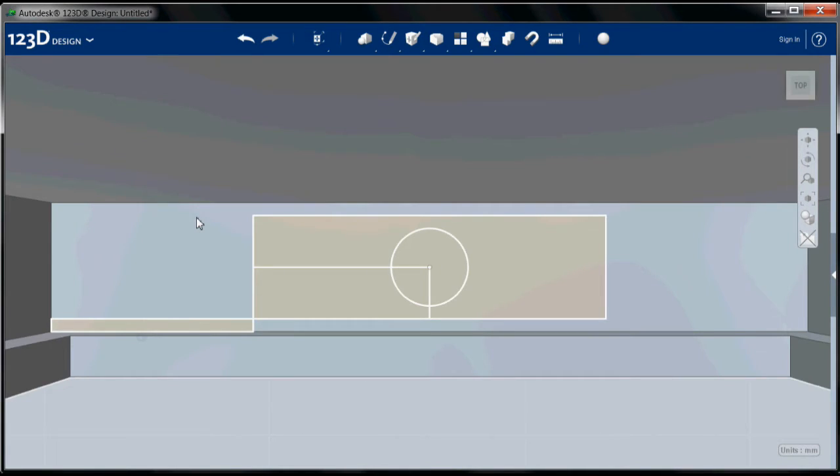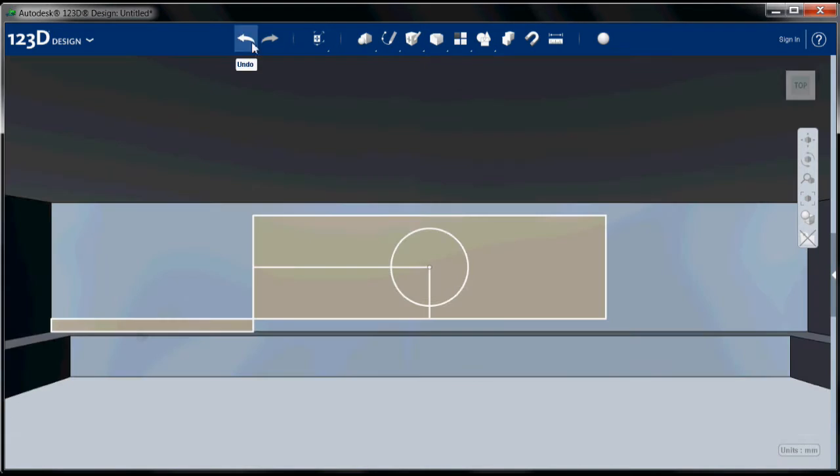Now I'm going to extrude this down into the solid. So I will choose the area I want to extrude down. I'm going to extrude the hole all the way through the part first. So I'm going to chain select with a control click and a control click both parts here. We could trim these out, but it's not really necessary. We can extrude the sum of these components. Construct menu, and we're going down, so I'm going to do like minus 40 because I know that will go all the way down through. There we go.